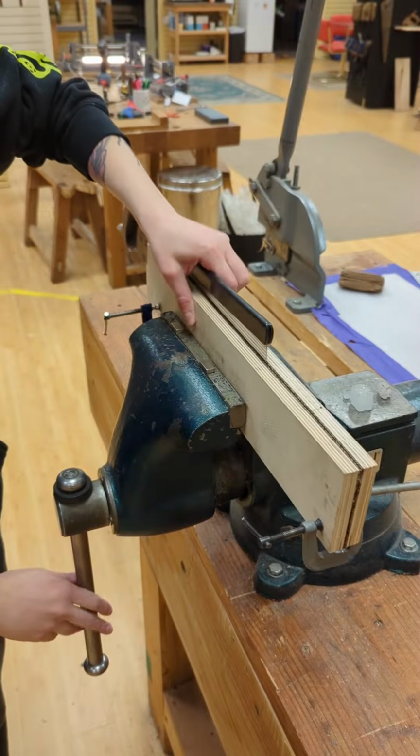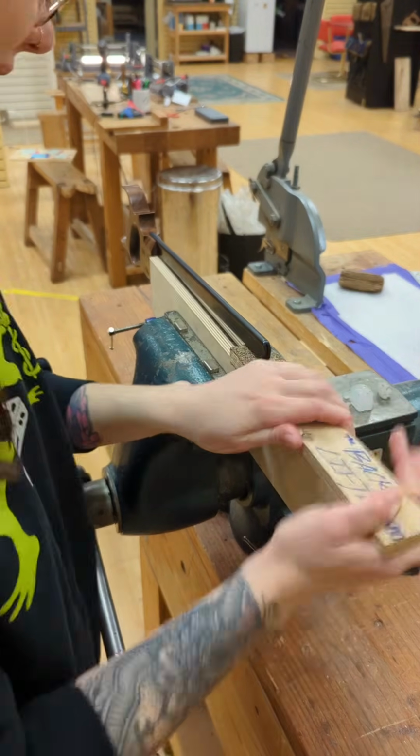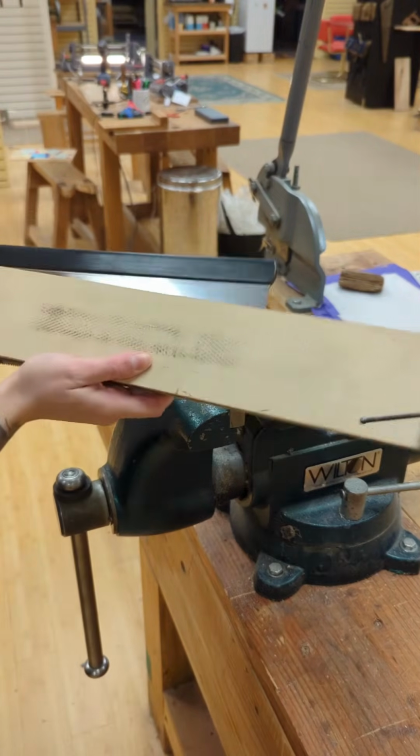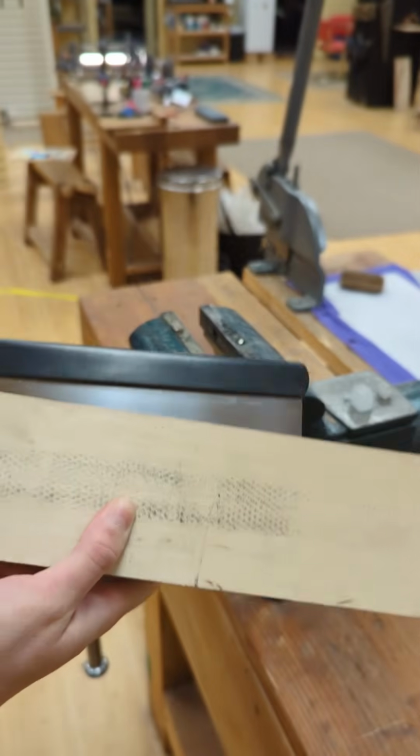After you get your saw into the work holding station, place it into your vise. Work your DIY back lifter under the back and lift upwards. Use caution not to lift the back over the top edge of the saw plate. The back only needs to be clamping on by about 1/8 of an inch.